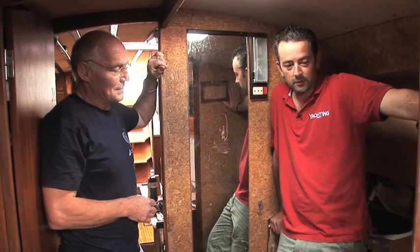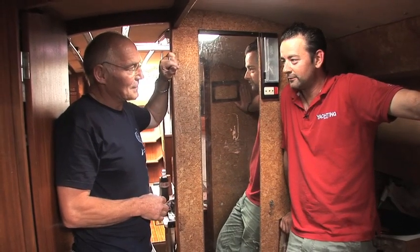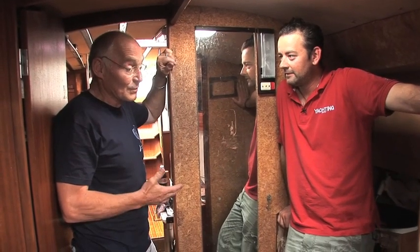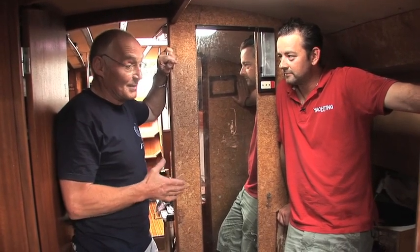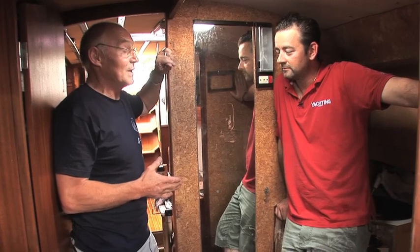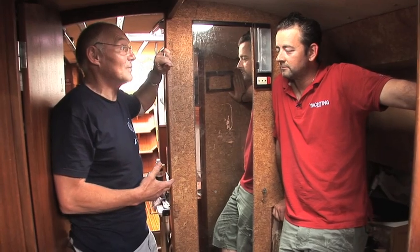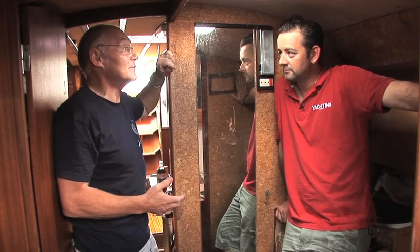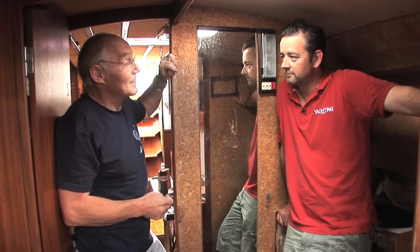Another fun day on the crash boat - I think we learned a lot. The red conical sponge was interesting and the putty stuff was great. Did you imagine vegetables would be as effective? No, absolutely not - I laughed when you first told me, but it was a very green, biodegradable solution that worked well. What surprised me is just how much water coming in quickly invokes a certain degree of panic, even under these controlled conditions. The watchword is: get the leak stopped quickly to buy yourself some time, then you can cope with the panic and deal with the situation.